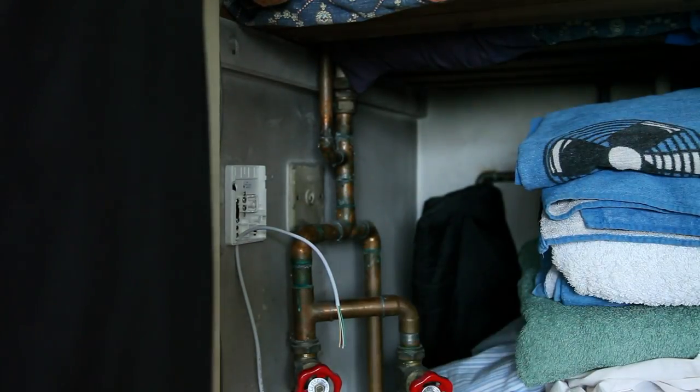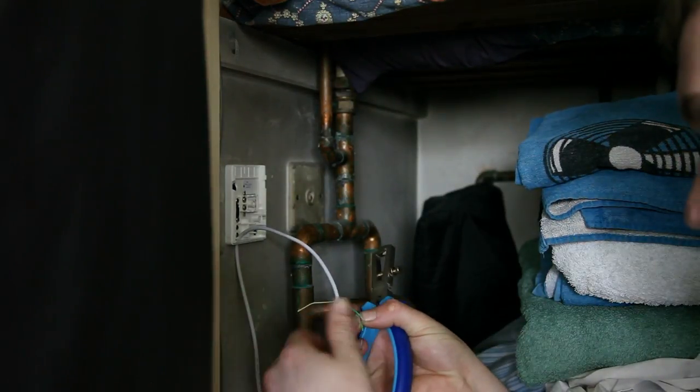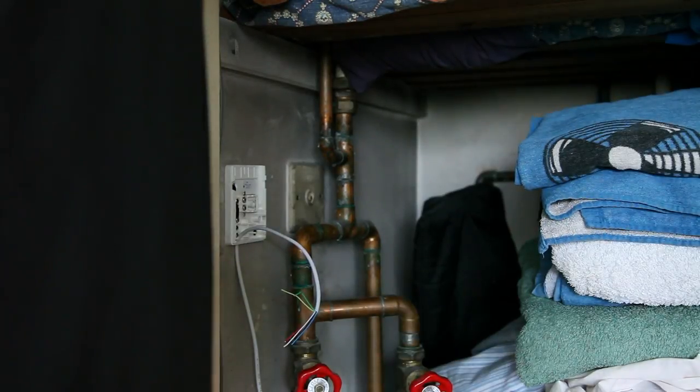Pull that off with your special strippers, then refer to your colouring wiring. For the zone, I'm just going to use alarm green and yellow. We don't need the rest because we're not hooking up the tamper, so we can just cut the rest off with your little snippers.